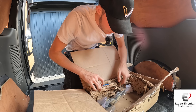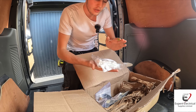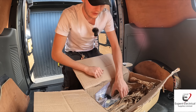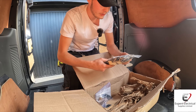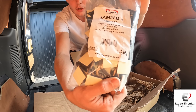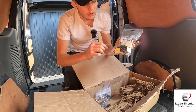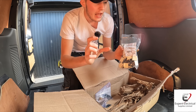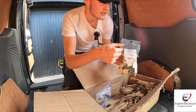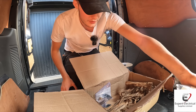We've got some more goodies in here. We've got some white stuffing glands, as you know, for your junction boxes and all that. They'll be amazing. We've also got sticky pad cable tie bases - I'll just give you a little close-up. They're great for sticking on things like under your kitchen cabinets for the LEDs, or anywhere you need a fairly good fixing with your cable ties. They're 3M sticky back so you just stick it on and then cable tie your cable to that - a real time saver.